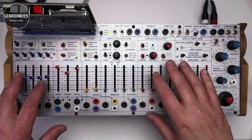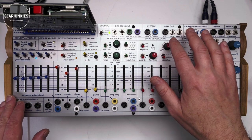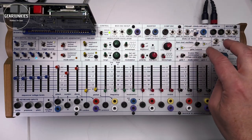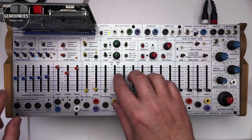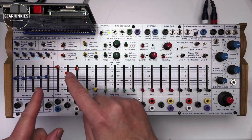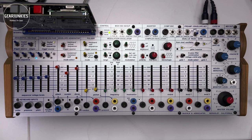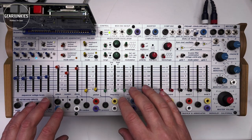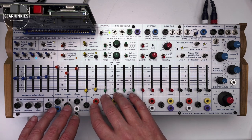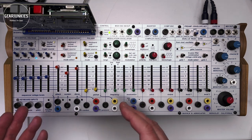The layout of the easel is quite clear, with the program interface at the top, various in and outputs, an inverter, preamp with envelope follower and two mix outs in the upper section. In the middle, this slider section with, from left to right, the sequencer, envelope, pulser, oscillators and VCA section. And at the bottom a set of in and outputs for control voltage. Buchla uses banana plugs for this, where you can also stack the cables to control multiple inputs from one output.